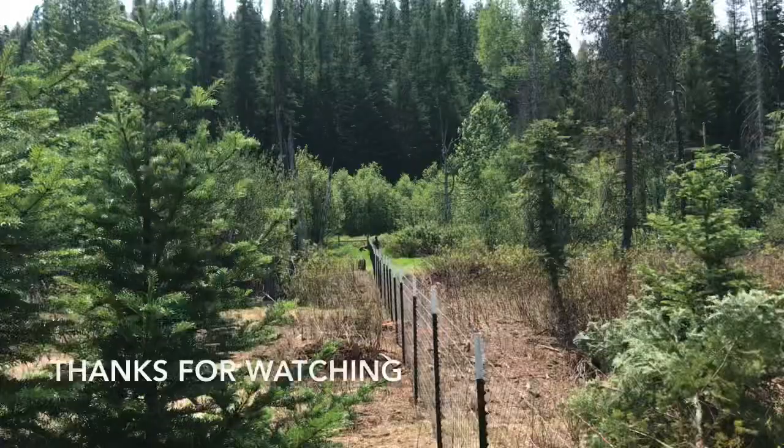All right, we got it tight. So the tractor is in park, holding the tension. We got it too tight. We pulled it too far. Shelby started to hear popping on the other end. Wasn't sure what it was, so she stopped me, but she was watching the fence and not the corner post on the other end. And the corner post started to, it is now past plumb.